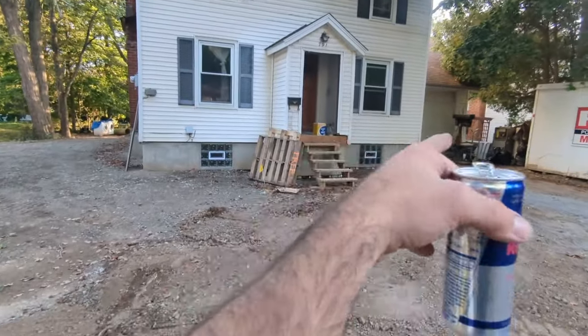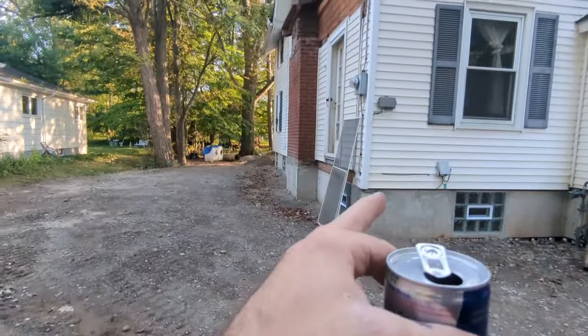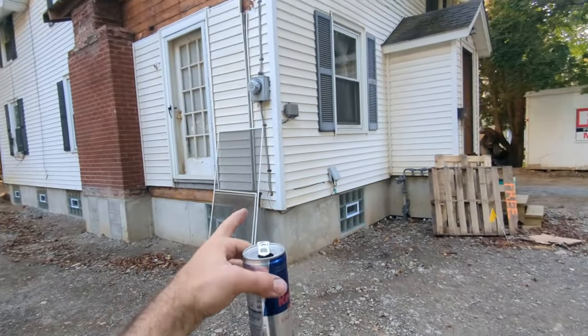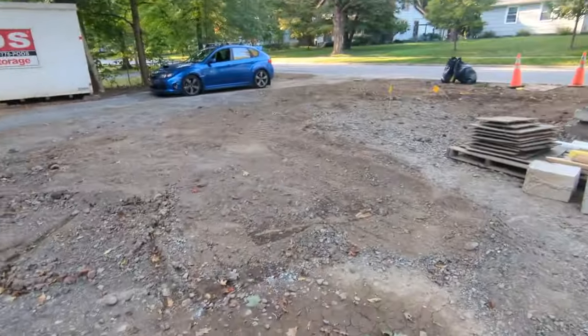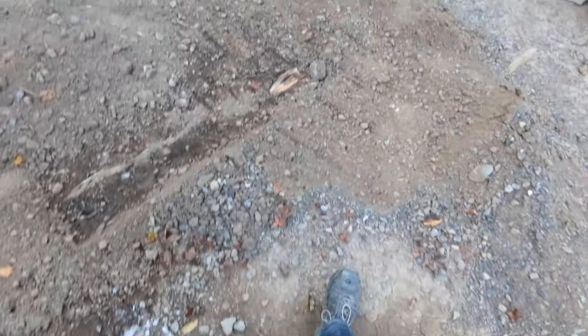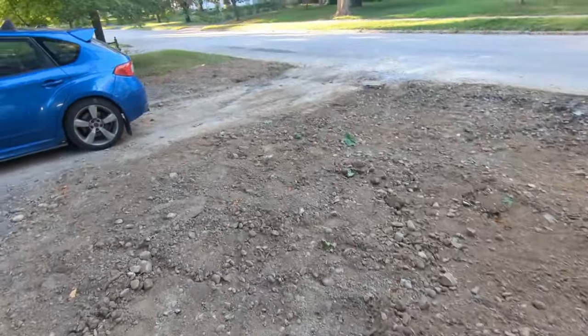We'll slap the 1, 2, 3 around the corner, 4, 5, 6, 7 window wells on. About 1 foot tall ones or something. And then we can grade from the top of those down, and we'll have a real strong flow away from the house here. We're going to cover this type of slimy clay up real good. That root. All this oversize that was put in here so that the trucks didn't sink. We'll get it all spread out.